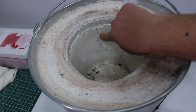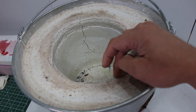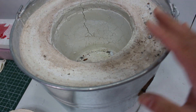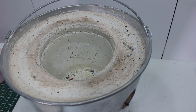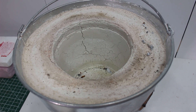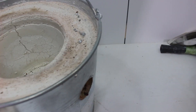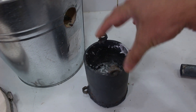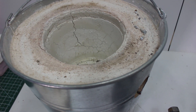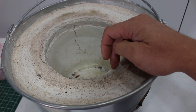My impressions of this DIY forge: I've used it about three times and it's already starting to crack from the heat and use. I don't think this plaster of Paris and sand refractory is a very good material. It works, but it took forever for this foundry to heat up — well over 15, maybe even 20 minutes before the crucible got hot enough to start melting aluminum cans. Once it got up to temperature it was easy to keep, but it's just not very efficient.